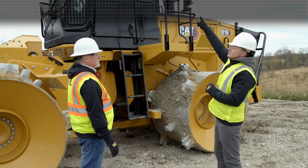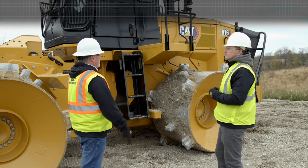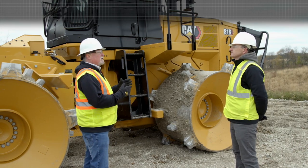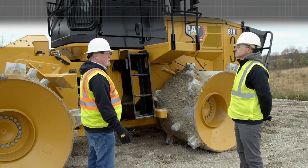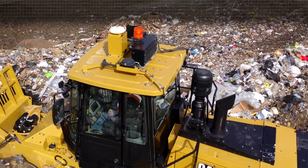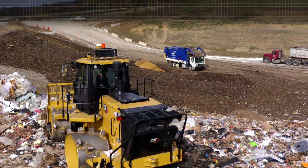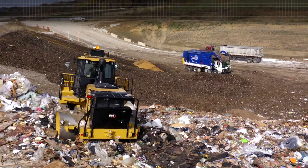We put our AC condenser up on top of the cab. Can you tell us why Caterpillar does that? Years ago, we took the condenser for the air conditioner out of the engine compartment. Because the fans reverse, it would blow hot air back through it — sometimes fogging up the windows inside, and it was hard to keep the cab air conditioned on a hot, sunny day. So by removing the condenser out of the engine compartment and placing it up on the roof, it's high away from the debris, keeping it clean with the freshest air possible for a landfill, and it has self-contained motors for the fans to blow air through the condenser up there.